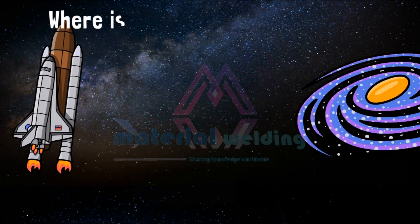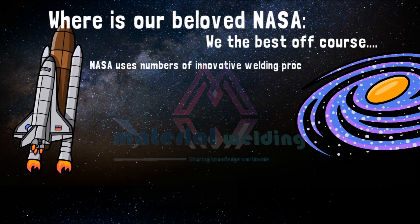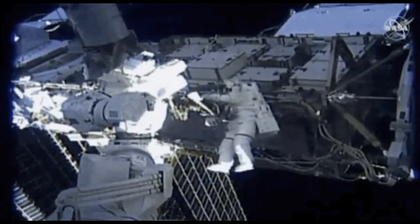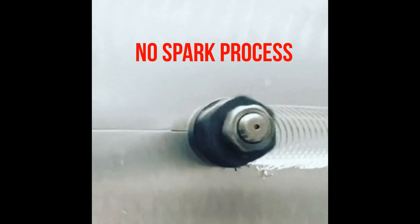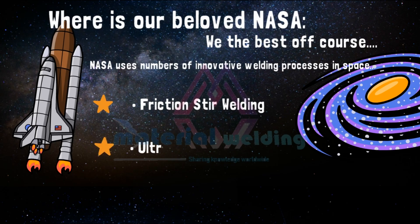So where is NASA in all this? Nowadays, NASA employs a number of innovative welding techniques that enable spacecraft to withstand the rigors of space travel while also allowing for some repairs to be conducted in space. First is friction stir welding — a technique that uses frictional heating with forging pressure to produce high strength bonds essentially free of defects. A rotating pin tool softens, stirs, and forges a bond between two metal plates to form a welded joint. NASA has developed a brand new design for a friction stir welding tool.